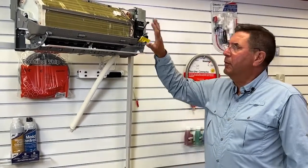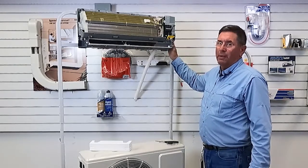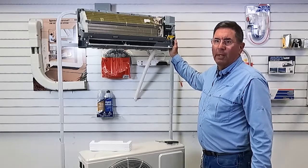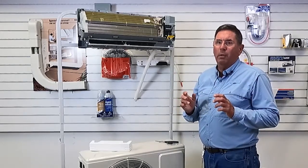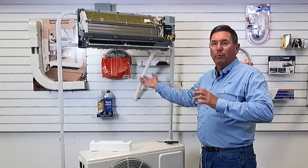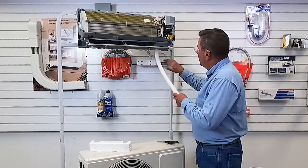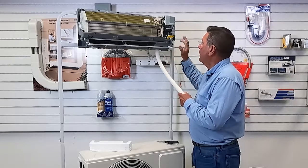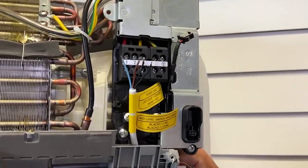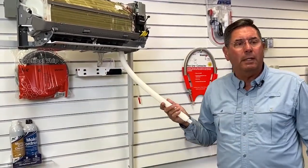Now we've turned the unit around — this is what the head without the decorative outer shell looks like hanging on the wall. This is bare bones so we can show you the interior work as far as chasing lines and connecting the condensate drain. First and foremost, make sure you turn off the power to both the indoor and outdoor units. The indoor head is fed by the outdoor unit bringing power in, and in some cases there's a three-pole wall switch for the indoor, so make sure all power is off before proceeding. The light blue is your common, the brown is your hot lead, and the two blacks are for your safety switch or breaking the temperature sensor of the air conditioner.